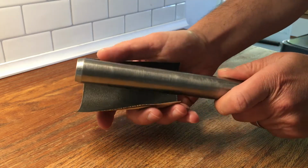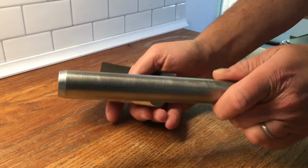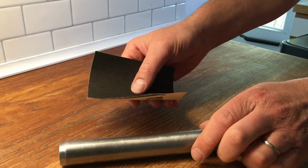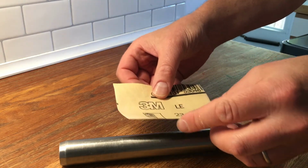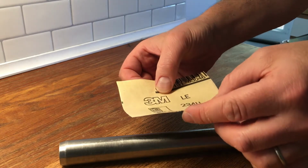If you have access to a lathe, while the shaft is spinning, hold the emery cloth firmly to the marked shaft area, creating the proper finish. Do not slide the cloth on the shaft, but instead lift and lower, overlapping as you go.